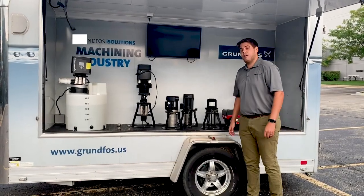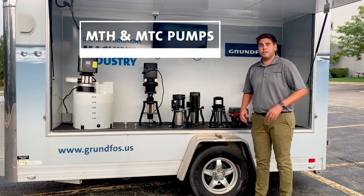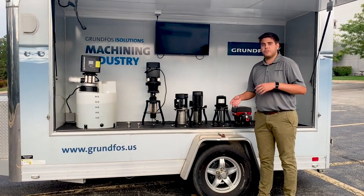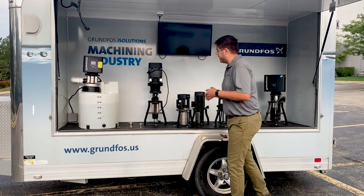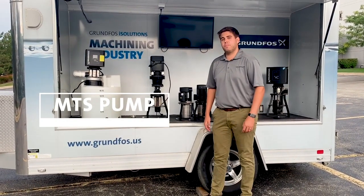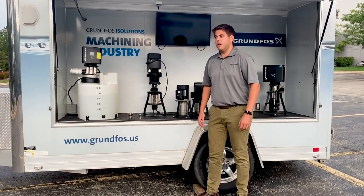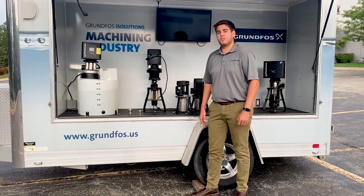The little brother of the MTR pump is actually the MTH and MTC. This is a little bit more of a compact unit because you don't have the split coupling — it's a single shaft; the pump shaft and motor shaft are the same. A really good pump for tight or small applications. Coming over here, we also have our MTS pump, or machine tool screw. This is a positive displacement pump particularly used in grinding applications where they need really high pressure coolant — this goes well over 1,000 PSI and is really good for high pressure applications.